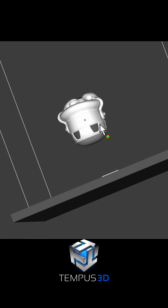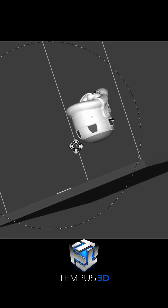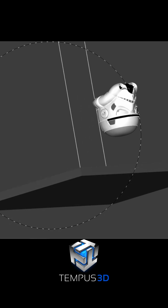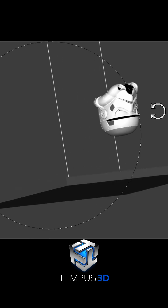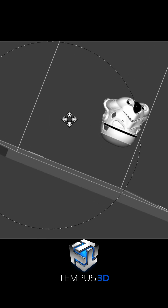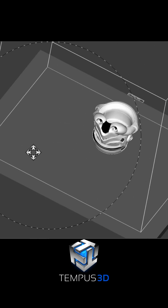The second reason is that with MJF printing, the bottom surface will always have a better finish. Because this is an art piece that will mostly be viewed from above, I wanted that section to be facing down. There are a lot of other considerations to take into account to prevent various defects, like in any other type of manufacturing.